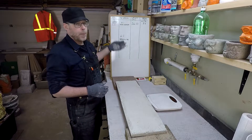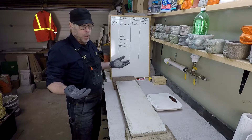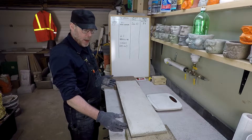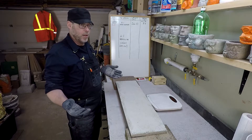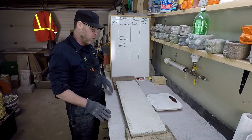We have a control group up here — three parts sand to one part cement, basically full-strength mortar. It's pretty heavy at 26 pounds for a 28-inch span that is one inch thick. The control group has a strength to weight ratio of 3.61 — it weighed 26 pounds and was able to hold 94 pounds before it broke.